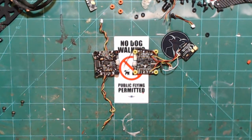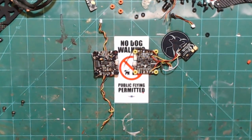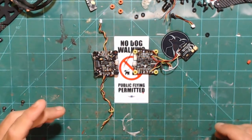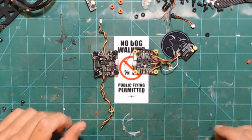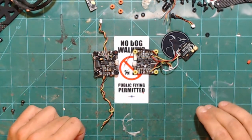They perform about the same. The regulators, in my opinion, on both of these are weak. I've gotten noisy FPV out of both of them. I've had one decent one that runs in my five-and-a-half inch Proton as far as the Bardwell F4 goes. Pretty much everything we buy in this hobby is mass-produced as fast as it can be. We put so much on these boards that it becomes a hot mess when you pump 5S or 6S power into them. You put caps on to protect them, and then you have these tiny little 5-volt regulators working so hard to bring that voltage down to power your receivers — or 3.3 volts for your Spektrum stuff.